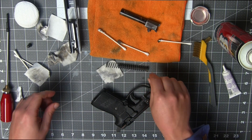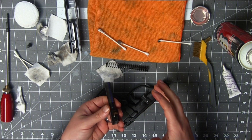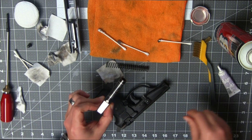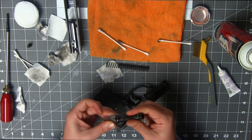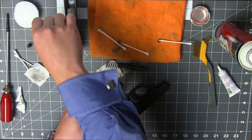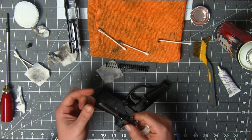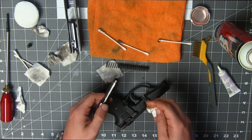Go ahead and replace the spring. Turning to the barrel, you can see where your wear points are. The interior of the barrel, I would leave it with the CLP — there's no need to do anything else there. The lugs and the barrel itself, I apply a little bit of grease. Again, most of that's going to get wiped off — you just want to see a real light sheen. Same thing for the lugs. Using a clean bore swab, just wipe off any excess. Despite what people say, I've serviced these in multiple environments — this little bit of film is not going to pick up any considerable dirt. Anything it picks up is going to be small enough the weapon will have no problem clearing it.